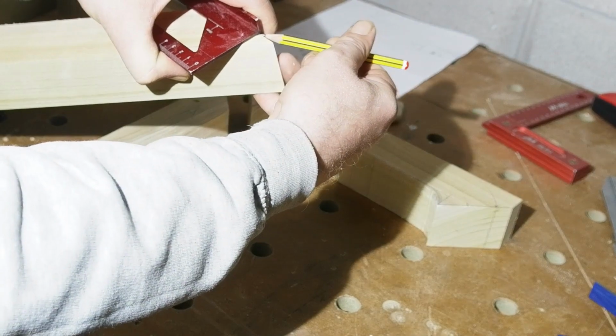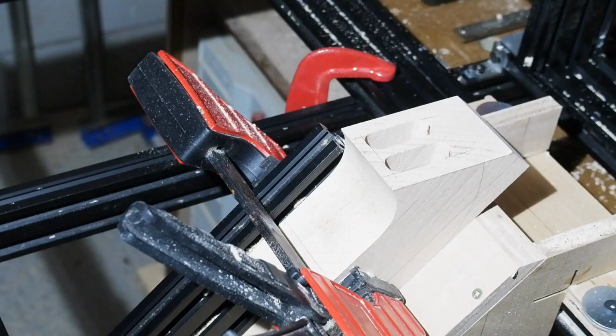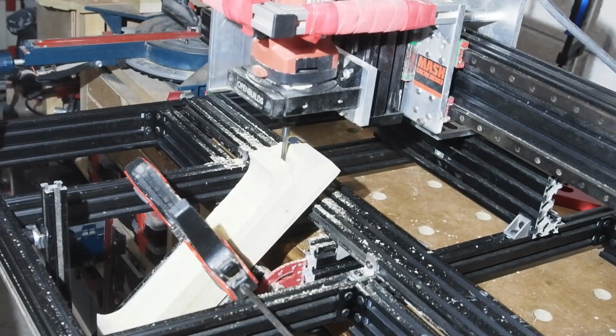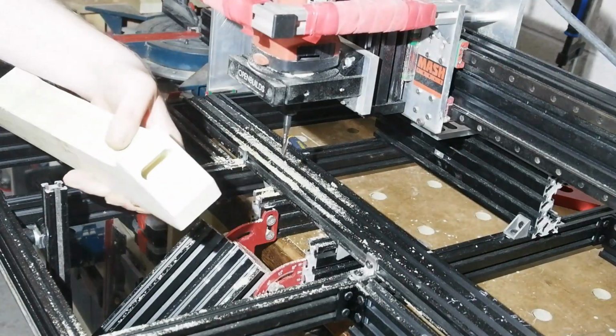Any of you that watched my reclining chair build might remember me doing a substantial double mortise and tenon, 12x36, for the joints. I'm trying the single mortise in this orientation as it gives me quite a bit more flexibility with more acute joint angles and increased tenon depth. In test it's proven plenty strong enough.